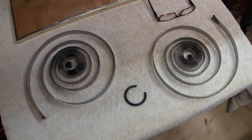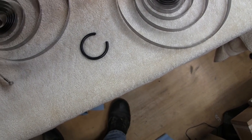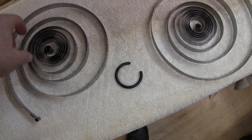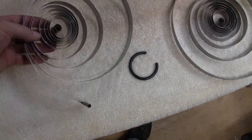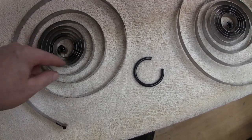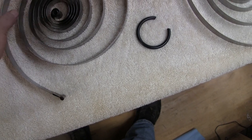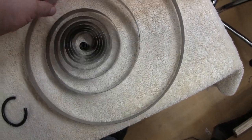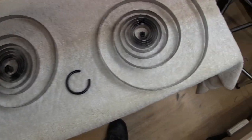I just briefly showed how I clean the springs by stretching them out and using a Scotch-Brite pad and WD-40, then going over with mineral spirits to take everything off — WD-40, then a dry cloth to wipe off the wet residue, then mineral spirits to take off all the WD-40. You can see this spring — the spirals were pretty concentric and really concentrated, and now you can see how much it's been opened up, just like the other one. Both these springs after giving them a little stretch, I think they're good to go.